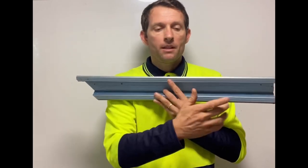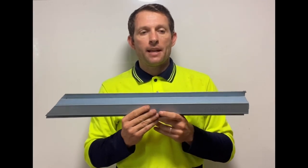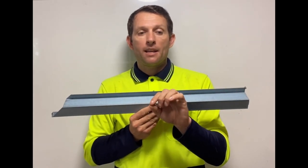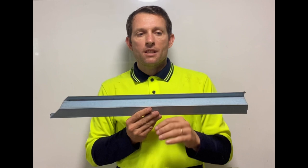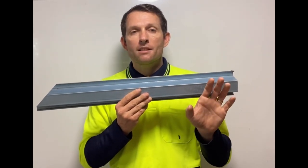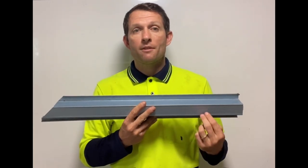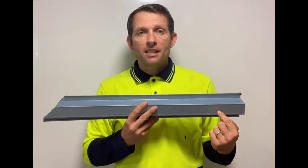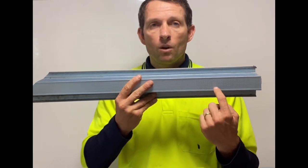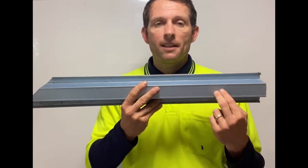Interesting. The SA HB 39 2015, at clause 7.8.2 and 7.8.3 part 4, also says fasteners should hit the center of the purlins. Both refer to straightness, but more so in an aesthetic form, not anything to do with the structural integrity of hitting the center. It doesn't seem to indicate in the standards that whether you hit the top of the batten, or bottom, or anywhere in between, that is going to affect the structural integrity of the batten, but you should try and hit the center.